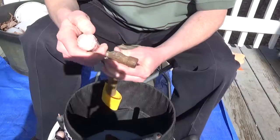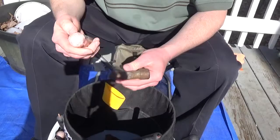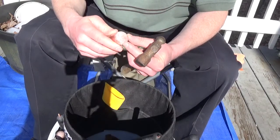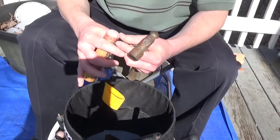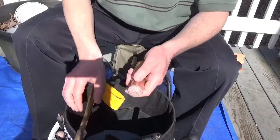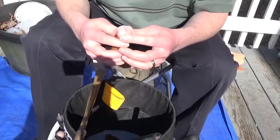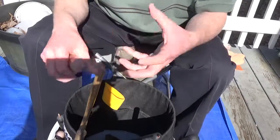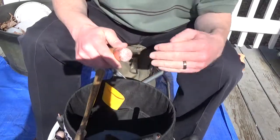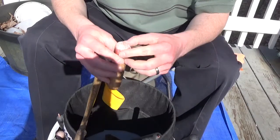My billets are pretty beat up. I don't do a very good job at keeping them as well maintained as I should. Once they start to get so chipped up, you'll see there'll be grooves and marks and divots and all kinds of stuff. Can you still use them? Of course you can, but you'll find that you'll start getting some more crushed edges. To the best of what I can figure out, when the copper gets too many marks in it, I'm feeling like maybe it has a hard time gripping the stone, because you've got little divots and maybe it's gripping in one spot and not the same on the other.